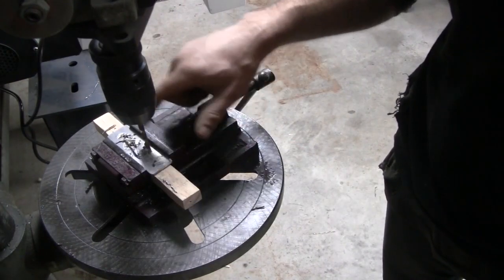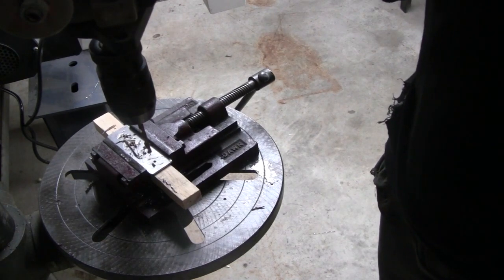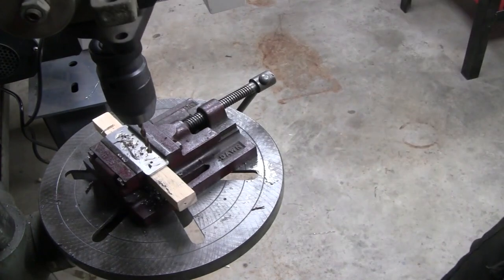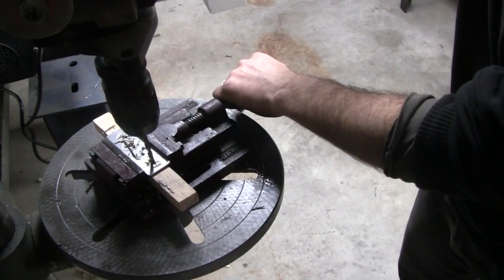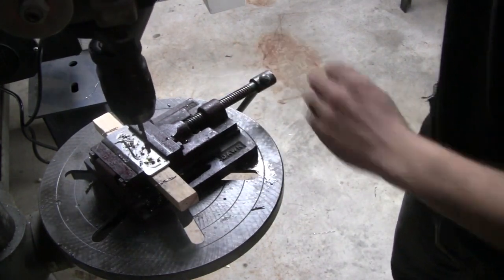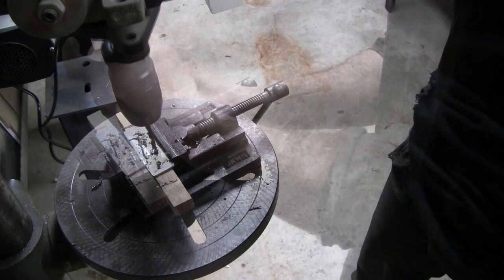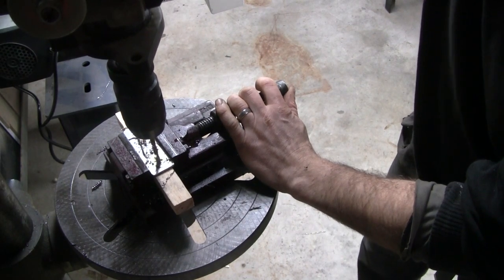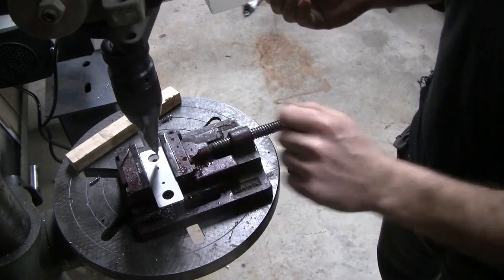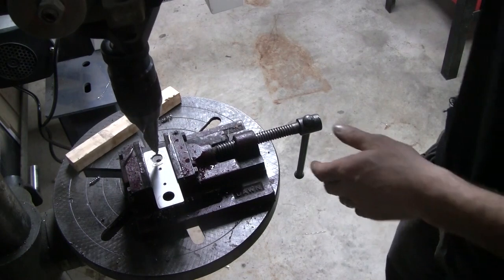No disasters yet. I need to open up these two holes further. I've got a 6mm drill and the drill is now at the lowest speed it will go, which is a hell of a lot slower than I would normally drill steel at with that size drill bit. That is not a happy drill — bit of a touch up on the grinder, let's see if that improves the situation. Up to 13mm, we need to go to 14mm, so I'm going to carefully open it up with my step drill, hopefully without destroying it.